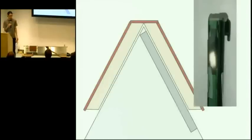For a real machine, if you want to do a lot of scanning, it's probably better to use a different sensor. There's a lot of other scanners that use a CCD sensor, where they have a lens and they project the image onto a linear sensor. And in that case, you could actually project the image all the way from the corner. It wouldn't have this kind of square restriction.